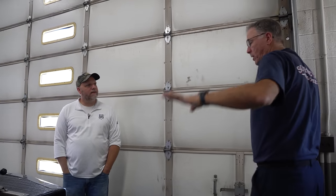These sprinklers will do good in an emergency — if fire's coming and we can't get out real quick, we can throw those down and help stop it. But for mobile attack, we want the direct line on the fire. The sprinklers offer more of an angled-out cover, probably about a 15-foot swath. And I can't control how much water comes out of these, so we want to save water and use the hose line. These tips look like our typical trash lines — but they're 20 feet because you don't want hose hanging from you as you're driving. All the plants and sticks catch the hose, and these guys are walking along with the hose on their shoulder, above the ground, moving as fast as I'm moving.